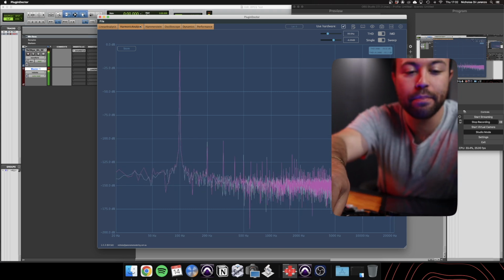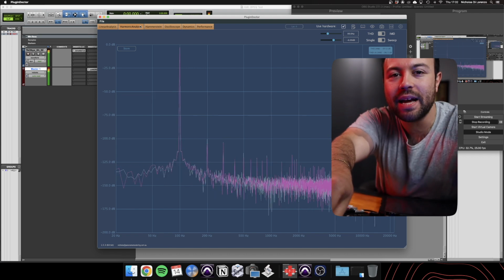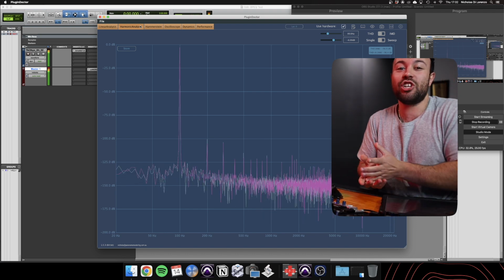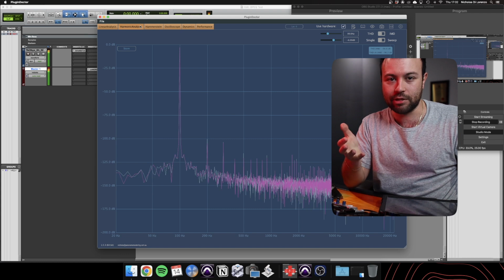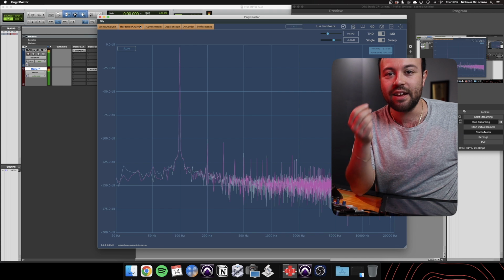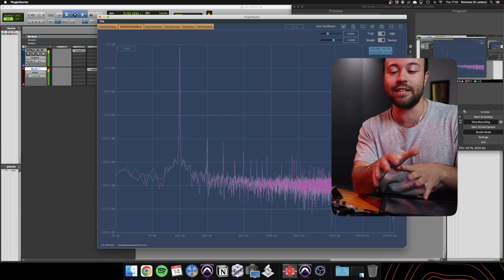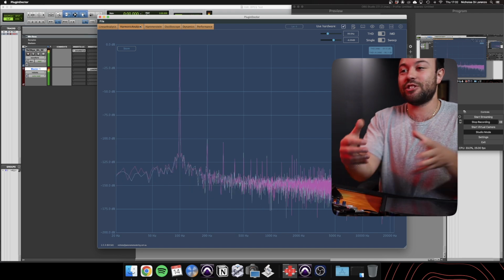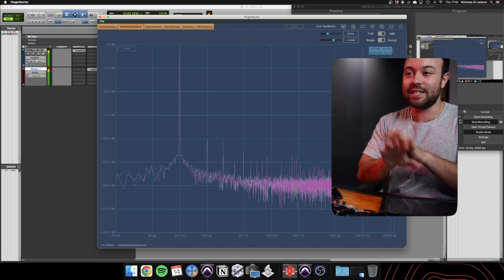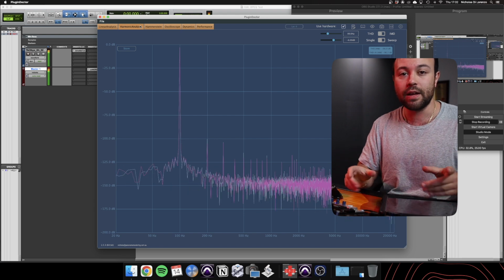Let's do a 5 decibel boost and really get this up against the ceiling at 100 hertz, and barely any harmonic distortion is introduced. This is namely achieved with its own low noise filtered power supply, and it's just inherent with the Barry Porter Net EQ. It's a state variable filter design which uses no inductors, transformers, or discrete gain stages, which means what you're getting is just purely electronic signal moving through. It's altering the frequencies and then stepping away. We're not using any tubes, we're not using anything that's unnecessary here to the signal.